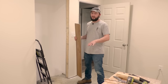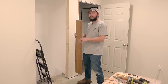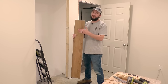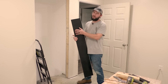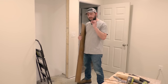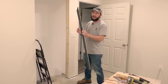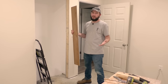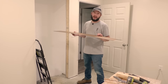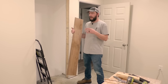When prepping the floor, make sure you don't have any staples or nails left over from a carpet. You can't go directly over carpet. They don't recommend installing this stuff in an RV or a three-season porch - that usually means it voids the lifetime warranty. Same with if you put an additional underlayment - it'll void the warranty because it already has one built in. Make sure holes are filled in and the floor is as flat as possible. A quarter-inch drop-off could eventually cause a plank to break from movement. This is a floating floor, so it will move around. Don't put any cabinets on top of it because it needs to expand and contract with weather changes and humidity levels.